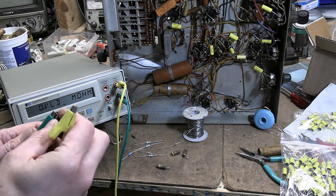This should be a 3.3 - it's 15. That's gotta go. This should be a 4.7 - it's 5.4. And so on and so on. I've been going through and replacing a lot of these. I'm going to end up replacing maybe half or more of the resistors, I suspect. This should be a 100 ohm - it was in the AGC circuit - it's 146, so it's 46% higher than it should be. This should be 470 - it's 640. So I'm going to end up replacing a lot of these resistors, especially the ones in the high voltage divider.